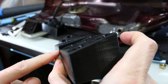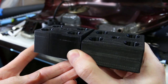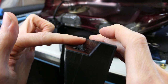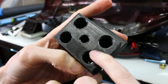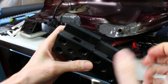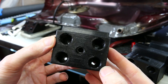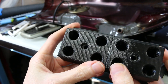My reference photos were very close although not perfect. I did tweak the design slightly by changing some of the angles, because although it would have worked since the bin is flexible, I wanted to get it as flush as possible. The gap for the top slot for the nut also needed to be slightly larger. I got away with hammering it in from the top but this caused the middle to break slightly. In my refined version, with a nut that has a flare on it, all the dimensions are correct — the nut just drops down in there and everything works as intended.